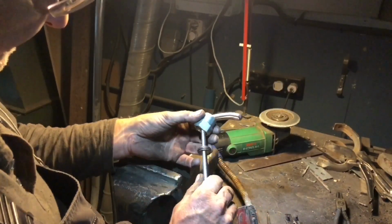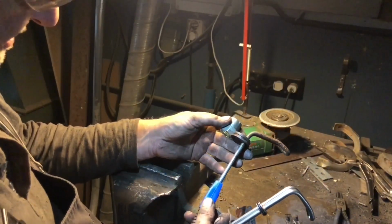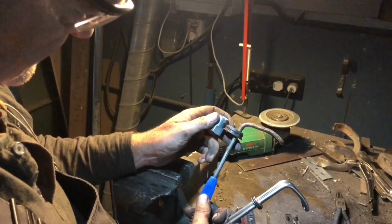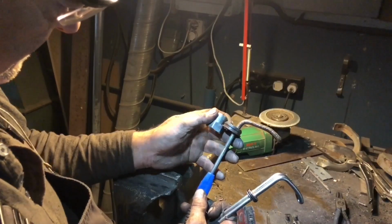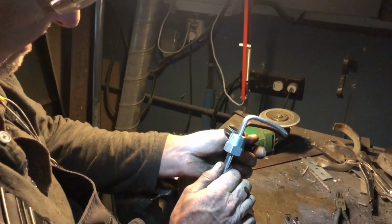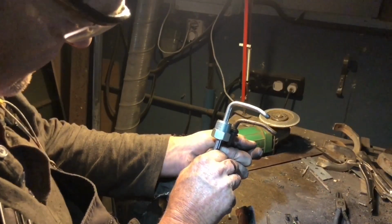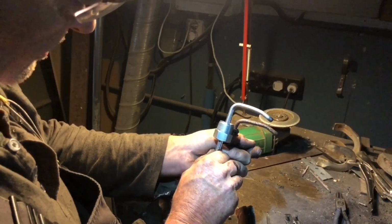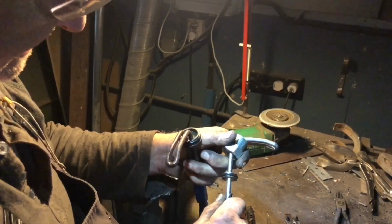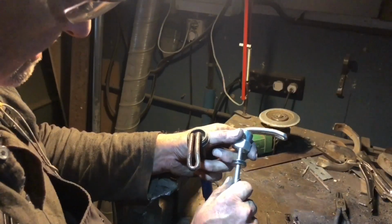So we've removed this from this screw housing, and it goes in and out there quite easily. But if we imagine, right, that wherever the end of that is, the end of that thread, that's how we need it to look. So on that basis, once that's inserted, we need it to come straight out of that thread there and bend immediately on that thread. Well, then I've got to ask myself, once I've done that, firstly, can I then get that in and out? Probably not. And then can I get it in the core plug in the engine? Possibly not.